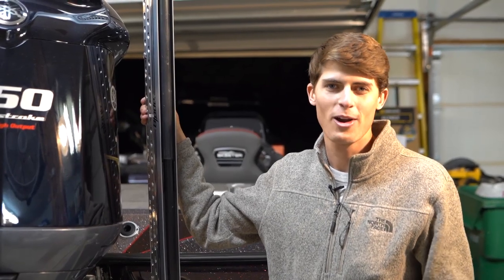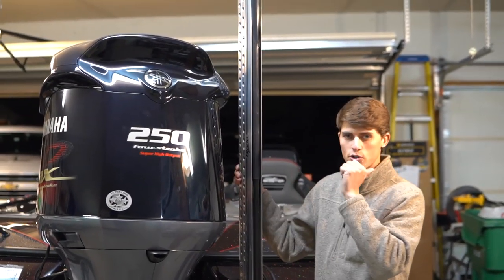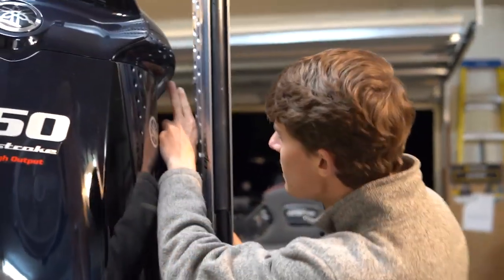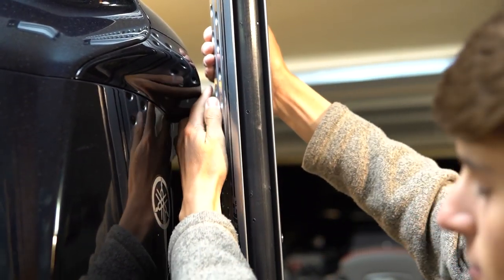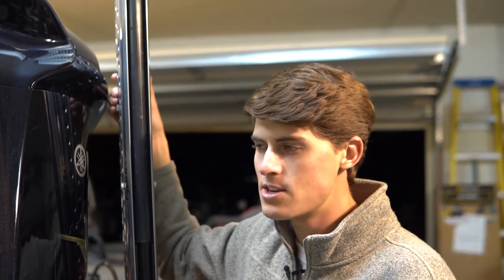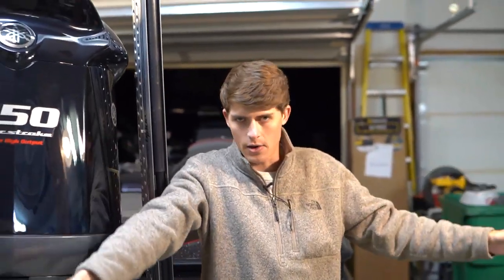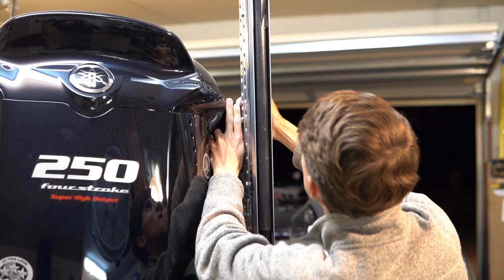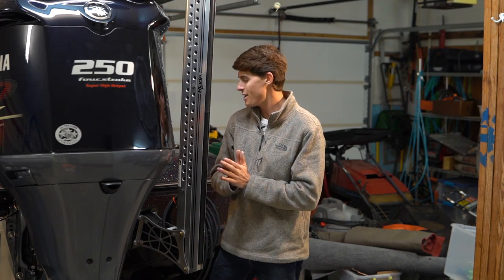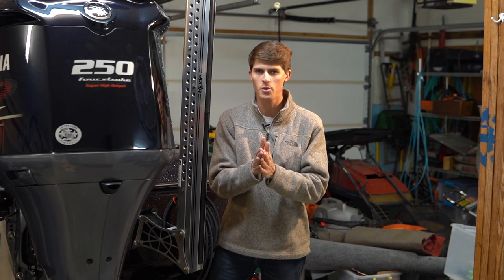Driving down the highway you'll see all different PowerPole configurations — some guys like theirs pointed in, some pointed out, some straight up and down. The way I like to do it is turn the engine as far toward the PowerPole you're installing as possible and get two fingers between the edge of the cowling and the PowerPole. The farther in your PowerPoles are, the wider your stance when they go down. I like a good two-inch clearance between the cowling and the PowerPole — with two PowerPoles like that, you are not going anywhere. Once they're in the exact position you want, tighten all nuts and bolts down, then move on to the second blade on the other side of the jack plate.